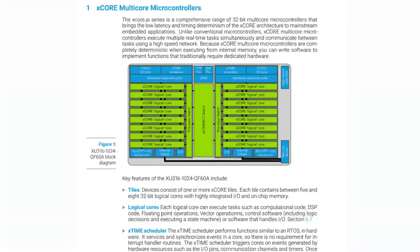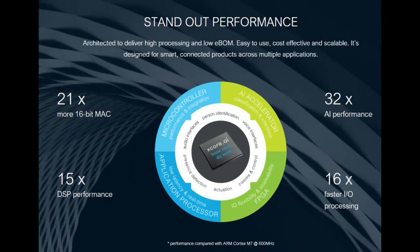What you're getting is 10 to 16 cores, all clocked really fast — this is a super powerful chip. It reminds me, it's not at all related to, but it's evocative of, a super ultra-powered Propeller chip for folks who remember that custom chip from Parallax — also had eight cores, special GPIO functions, and was a non-ARM Cortex chip. XMOS wanted to do a chip that was really good at audio processing — a very powerful microcontroller, multi-core, lots of IO capabilities, DSP. And now they've added some AI acceleration as well. Basically, it's really, really fast, but it's a microcontroller. You have FreeRTOS running on it, but you're not dealing with Linux or QNX. No operating system that takes time to boot — it's instantaneous, which makes it great for appliances, devices, cars, et cetera.